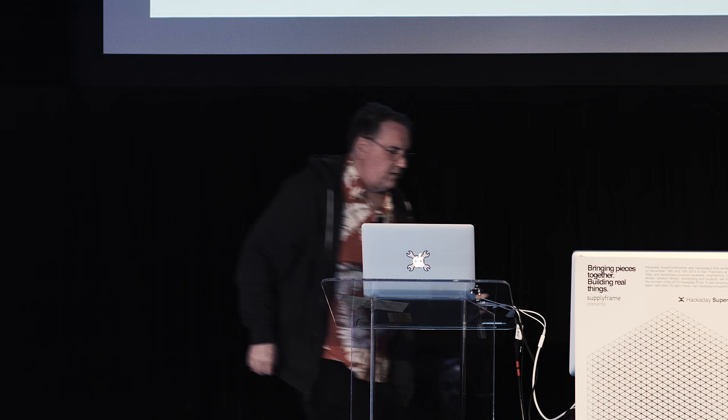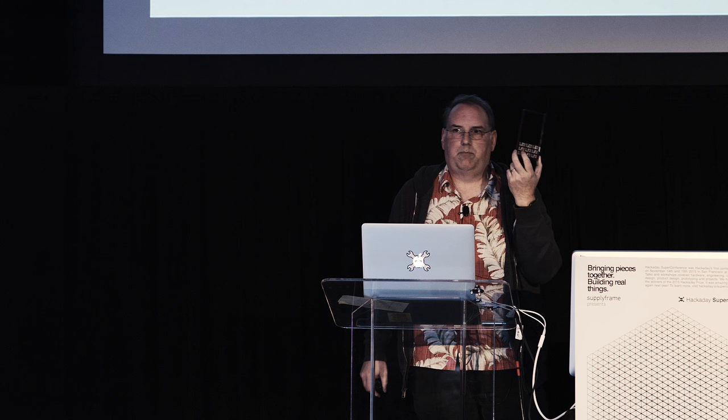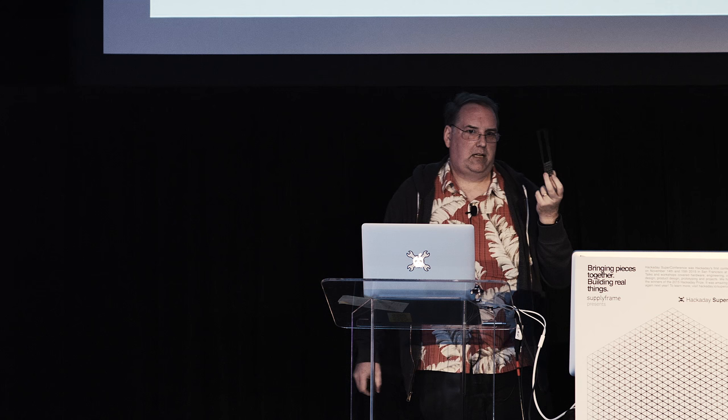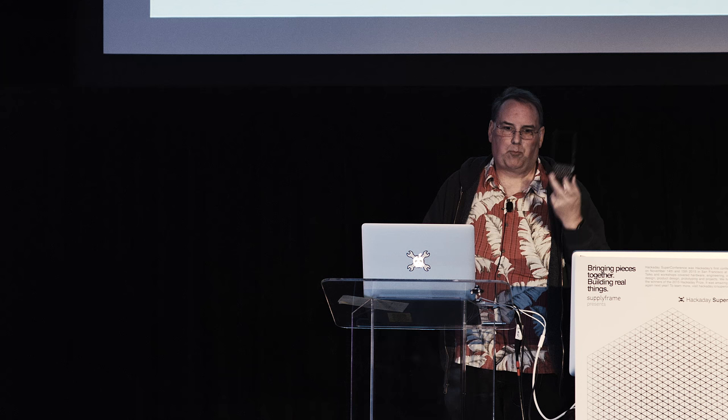When I made the crazy clock, that's these boards here, one of the things that I didn't understand fully at the time was how loading capacitance on crystals works. So these wound up being 130 parts per million too fast. When this was brought to my attention, I suddenly had to scramble to come up with a way to fix this because I had 300 of these, and if they were no good, that was that landfill moment that I talked about earlier. Fortunately, I was able to figure out a workaround in firmware that slowed the action of this thing down by that same 130 parts per million, and I could program the trim factors in EEPROM and all sorts of details